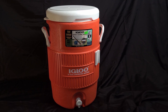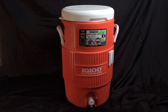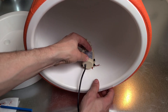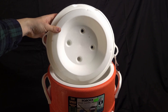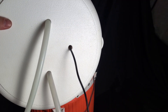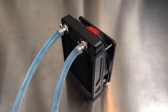To store the coolant and keep it as cold as possible for as long as possible within a small budget, I'm using one of these five-gallon igloo coolers. To circulate the coolant, I'm using this little DC water circulation pump, which I've glued to the inside wall of the cooler. To connect the pump to the radiator, I drilled three holes in the lid of the cooler through these conveniently pre-existing divots — one for the pump cord, and two for the silicone connection tubes. One of the tubes goes from the pump to the radiator inlet, and the other goes from the radiator outlet back to the cooler, dumping the coolant into the reservoir.